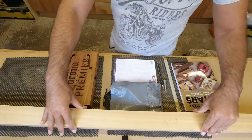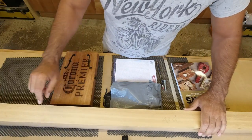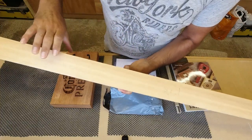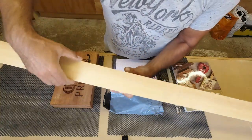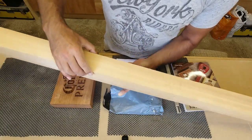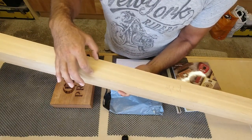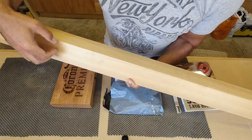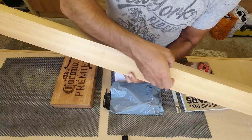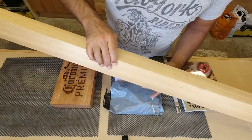I found this piece of hardwood in our scrap wood pile. Lou's dad kindly donated it to the project. It's got some absolutely gorgeous, really close straight grain with no defects at all. It's a nice big chunk so we'll be able to carve the neck shape out of it. We're going to mill it down, plane it, get it to final dimensions — about an inch and a half wide or 40 millimetres. It'll be double thickness at the heel where it goes through the box, coming down to about three-quarters of an inch on the neck, then we'll round and carve the back nice and smooth.